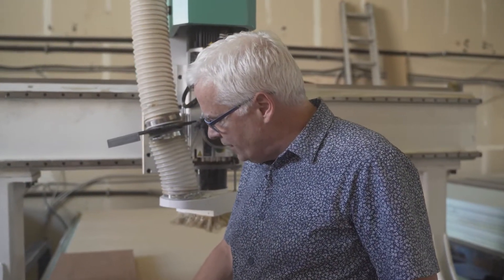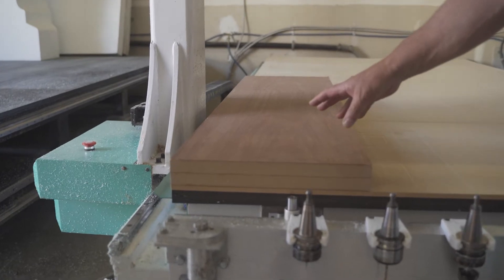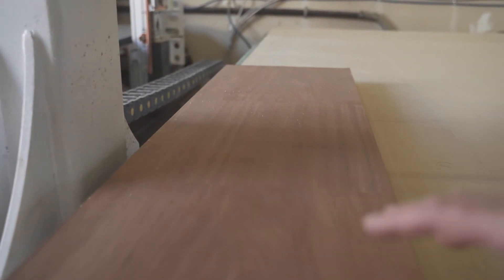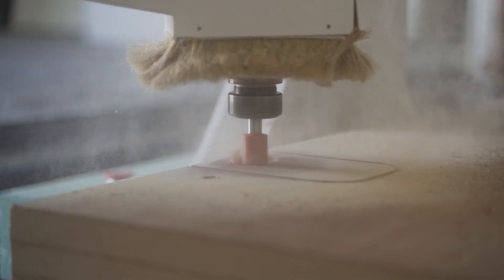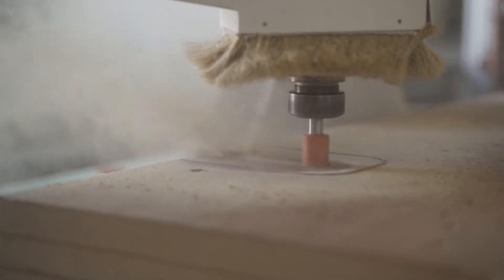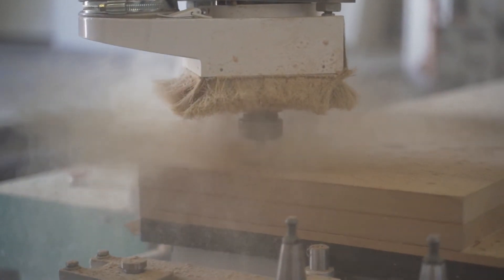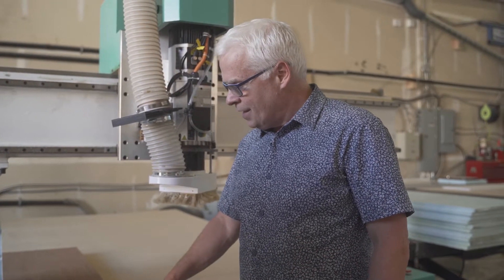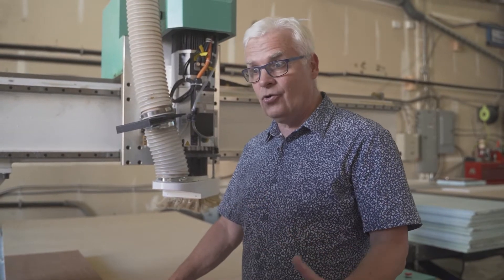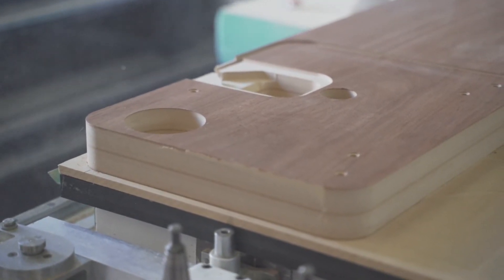Here's a sheet of our MDF — two inches thick. This panel will ultimately do three turntables; this is just to show you what it looks like before machining. We use MDF because it's an extremely dense product, machines extremely well, and has very little resonance. Solid wood just won't work for this application. MDF was not chosen to cut corners — it actually creates extra work — but it truly is the best core for a turntable.